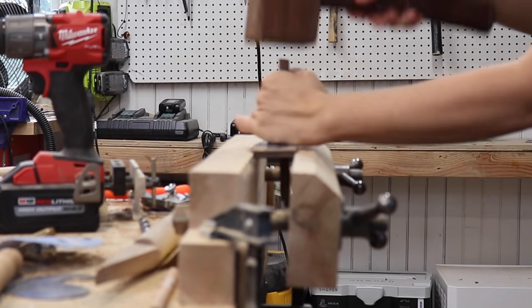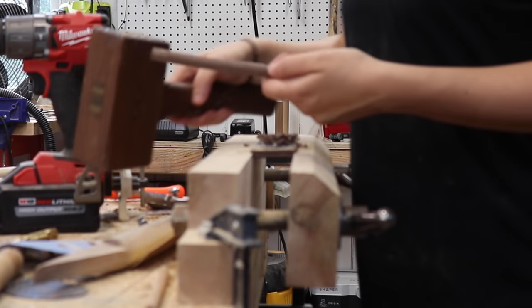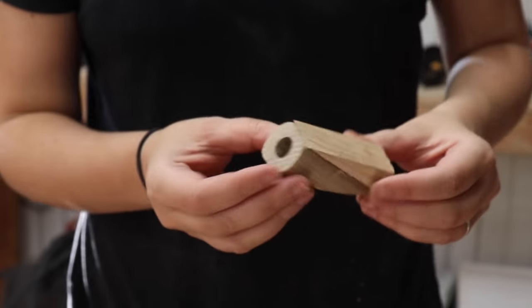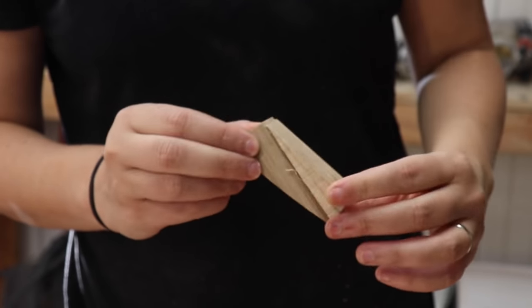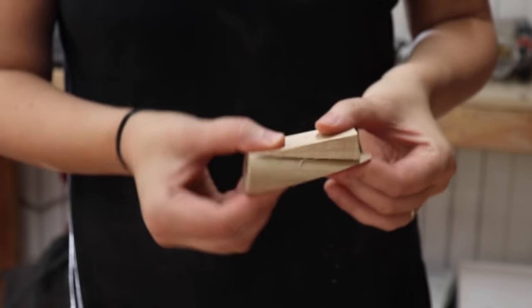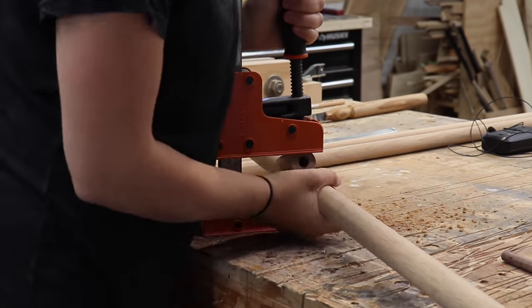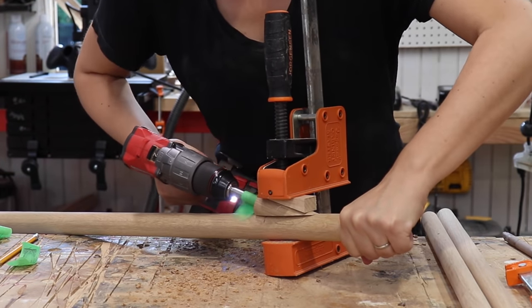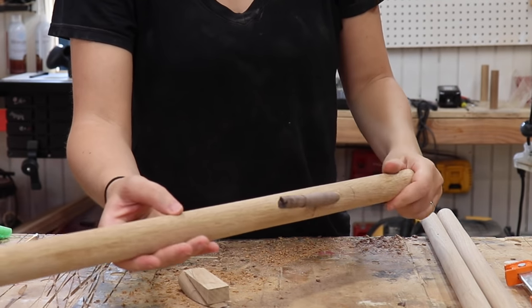To join these dowels, I made another dowel using a dowel plate. The next problem was how to drill the matching angled hole into the upright dowel for the joinery. So I took the cut-off from the 70-degree cut made earlier, sanded a slight curve on the inside of it so it could register around a curved shape, flattened out the top at the sander, and then glued on another piece that made up the rest of the angle so I had a parallel surface for clamping. This kind of looks like a custom pocket hole jig. The hole for the dowel is perfectly centered and at the exact angle I need, because it's directly referencing the angled cut from the other piece.